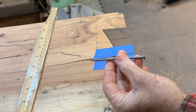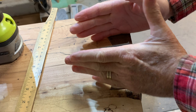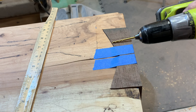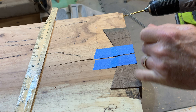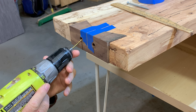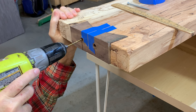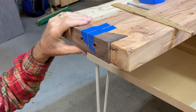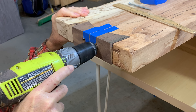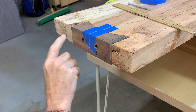I'm going to use this three-and-a-half-inch screw to snug this in and hold it straight. Since my drill bit's only so long, I'm going to drill through the walnut and into the pecan, then take the key out and re-drill so the screw can reach in far enough without splitting the wood. The brad point bit left a nice little center so I know exactly where to drill, making it easy to center the drill bit.